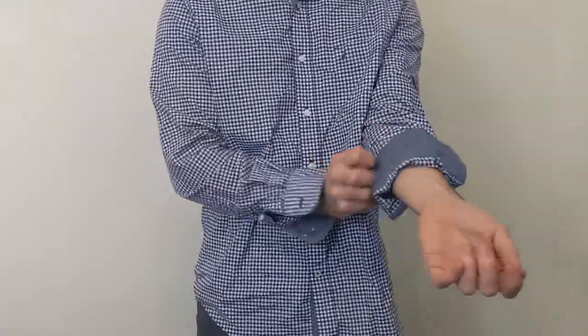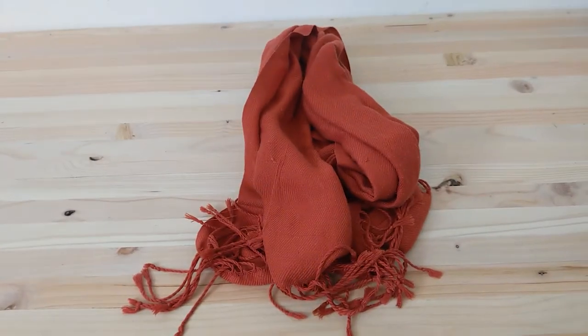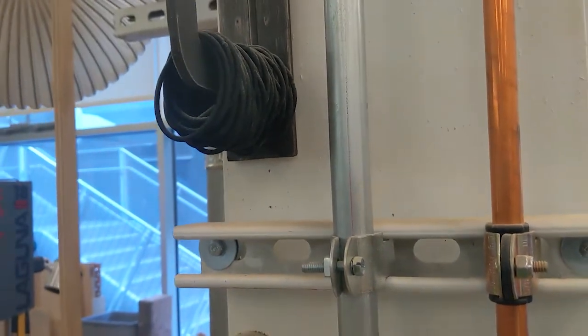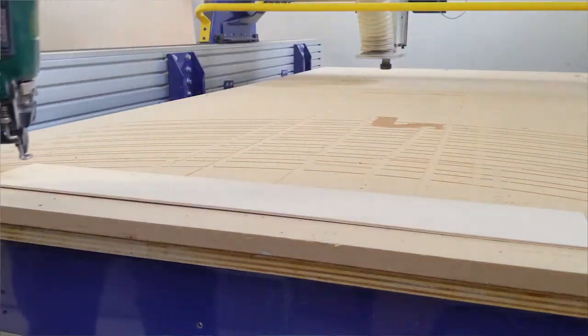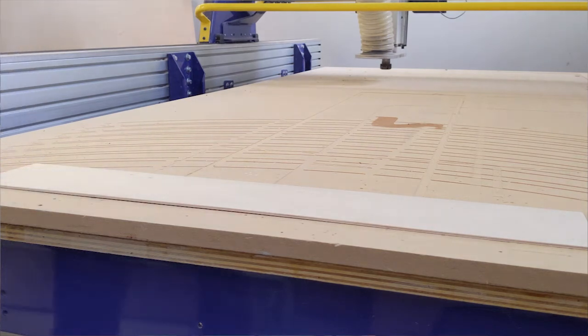If you have long sleeves, they must be rolled up — not pushed up, rolled up. Any dangling jewelry or accessories should be removed and set aside. Long hair should be tied back, and we have hair ties around the space in case you forget your own. Sometimes the best tool for holding down your material is our pneumatic composite nail gun. Even though it has a safe interlock at its nozzle, it will never be pointed at a human being. It also expels a gust of air from the back upon activation, so keep your face clear and wear safety glasses throughout.